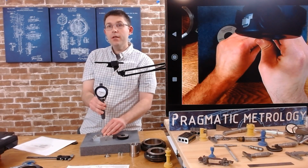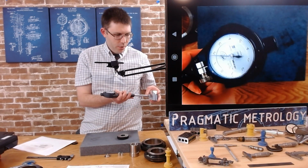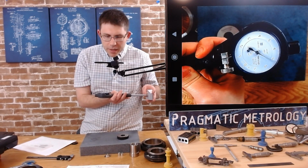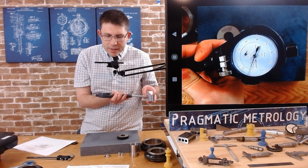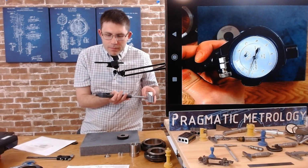and you can see the inflection point. Okay, we've got an inflection point. I'll show you on the secondary camera. And where's our secondary dial? We were just before the 4. Now we're just before the 1, so we've gone about 30 thousandths, although we haven't gone quite 30 thousandths. We've gone about 29 4/10.